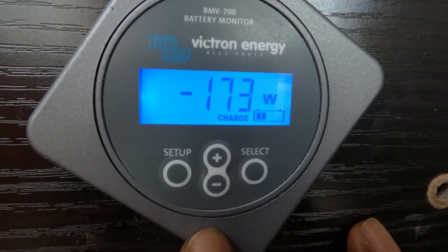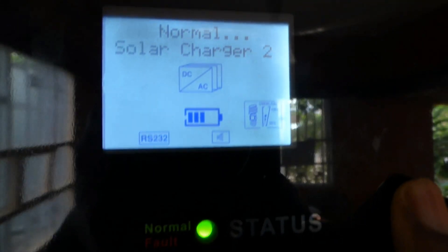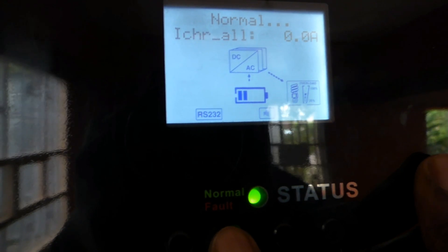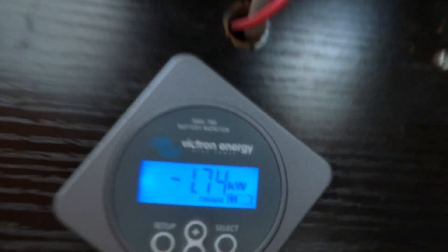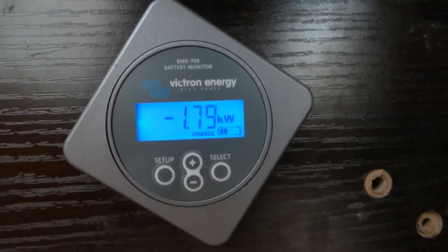As you can see, I'm discharging the batteries by about 171 to 184 watts depending on what the clouds do. We're pulling 2523 watts out of our system, and as you saw this is a negative 1007 with 1.76 kilowatts right now. We just had a cloud and the PV is not producing — we're pulling 1800 watts out of the batteries right now.